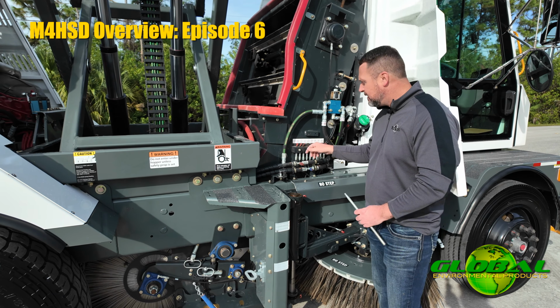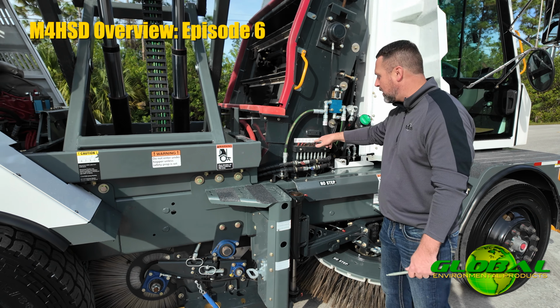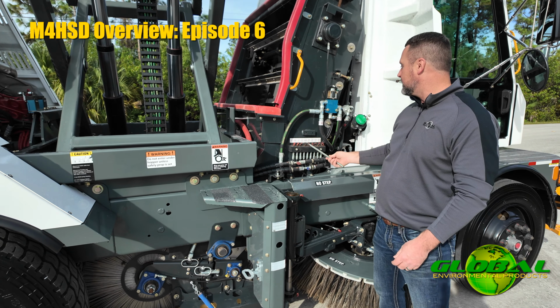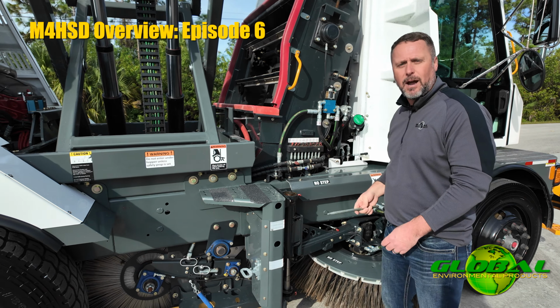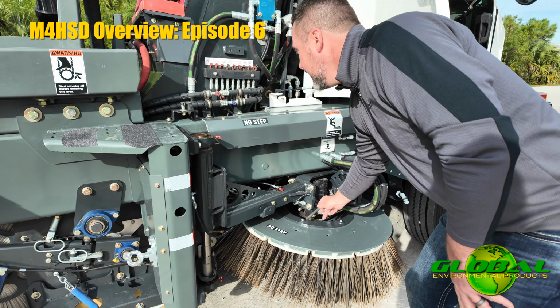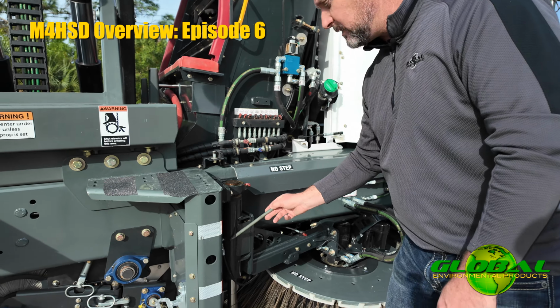Now those 9 points that are actually plumbed into this block, they're all labeled here on our sticker, and they're going to the high moving components. So you're going to have, for instance, at the gutter brooms, they're talking the motors and the lift cylinders. My right-hand gutter broom motor, that line is actually running down into the dish at the gutter broom motor here. And when they're talking lift on the right-hand side, that's actually going into this lift cylinder.